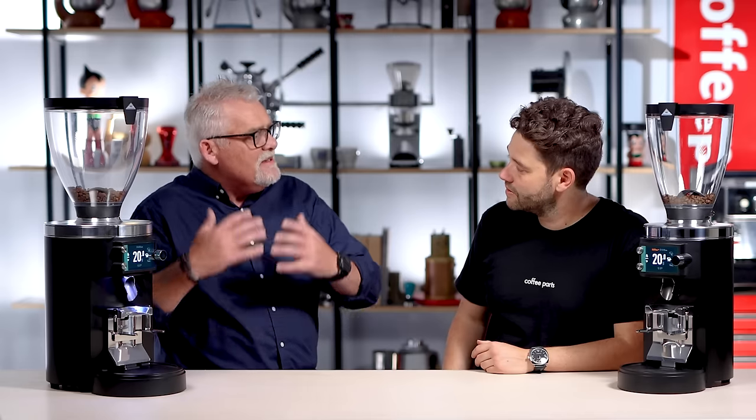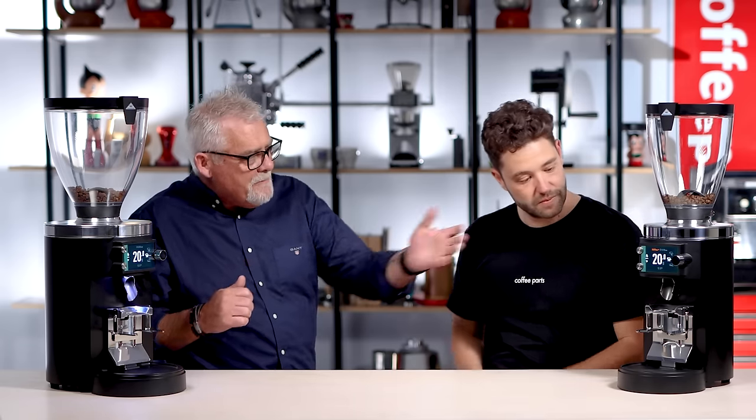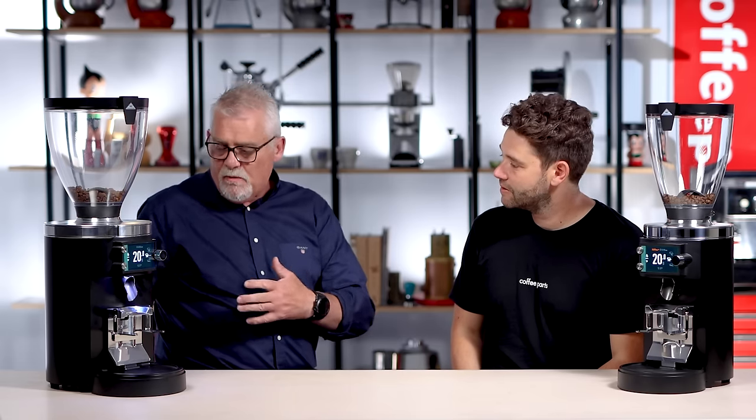The 65 Grind By Weight has been out for a while now — we've actually done a video on it if someone's interested, just on this specific unit. Great unit. It has 65mm discs in it and a single fan inside for temperature stability. On all of our Grind By Weight systems and even the E80 standard, we have adaptive fan control. The optimal grinding temperature is between about 25 to 30 degrees Celsius, so the fan control is designed to anticipate if you're getting to that temperature. If you're putting a bit more stress on the grinder, it may kick the fans in a little bit earlier to keep it cooler, or it'll wait until it gets to 25 degrees and then put the fans on to maintain that temperature, because that's best grind stability for our systems. Both have that, but the E65 has a single fan, while the E80 Grind By Weight has two fans — one in the base and one in the back.